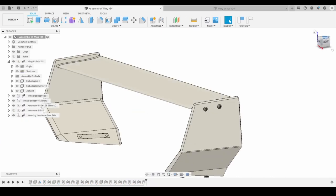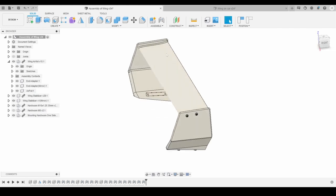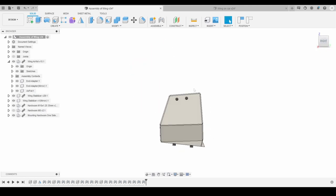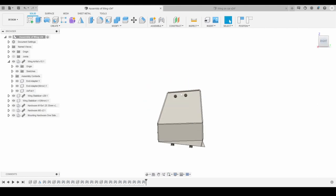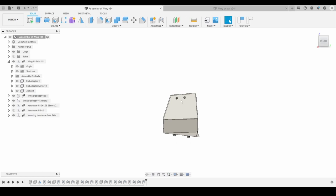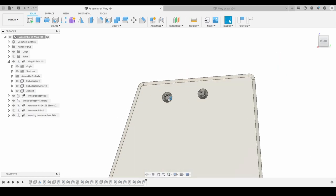One other thing is the angle of attack for this wing should be around 3 degrees sloping down, but that's not taking into account this slope right here that's flat with the trunk. So the true angle of attack, or pitch as they call it, is going to be slightly more than this 3 degrees that has this slope right here for the airfoil.